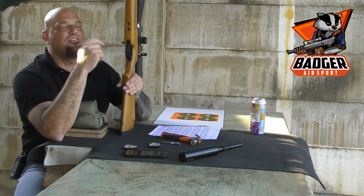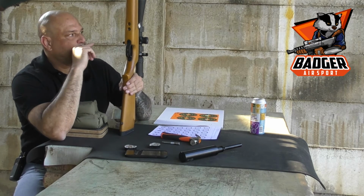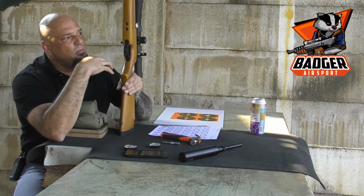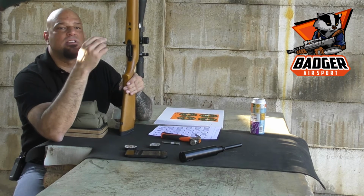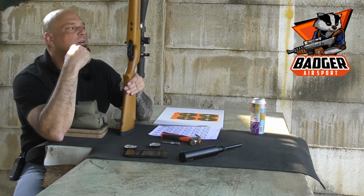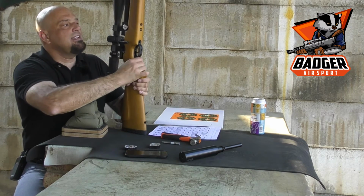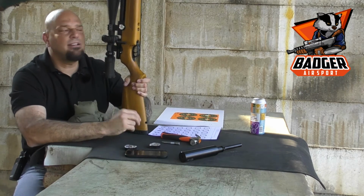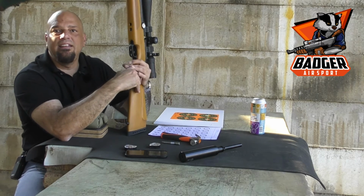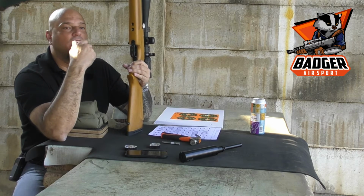Now, I've seen a few times at the range, when you open up that purge valve, and by the way, you just crack it open, the air will start coming out. Eventually it will sort of equalize, and you just crack it open a little bit more until you get a 0 on your regulator settings here on the right hand side. But when you start filling the cylinder again, please ensure that that purge valve is all the way closed.